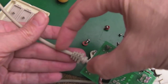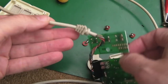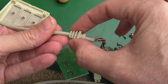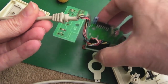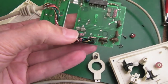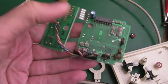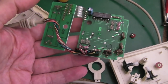But we know the damage is somewhere here. It's a pretty short cable and if I trim it down it's going to be even shorter. I'm reluctant to do that. I think the first approach I might try is to remove this grommet and then split the outer covering, see if I can work out which wire it is. I think it's going to be the ground - I would assume the buttons go between an input signal and ground, so it's probably the ground that is damaged.